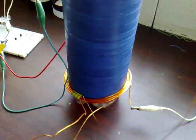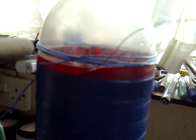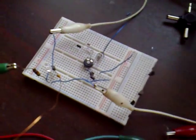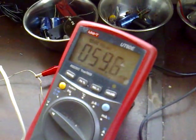I'll show you the setup. This is the large Slayer coil here, and that blue wire at the top — above the windings — that's my pickup coil. There's just four turns of bell wire. I'll switch the circuit on. The Slayer circuit is on this prototyping board. It's drawing about 60 milliamps, and this little motor is spinning away like a good one.